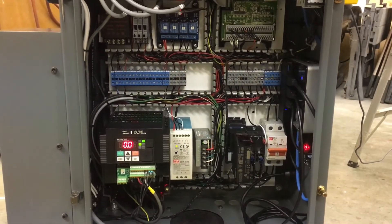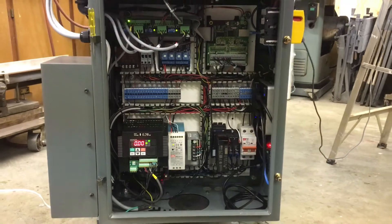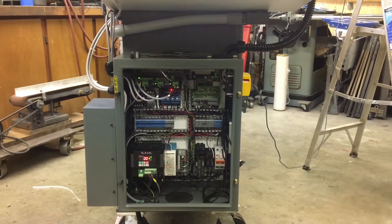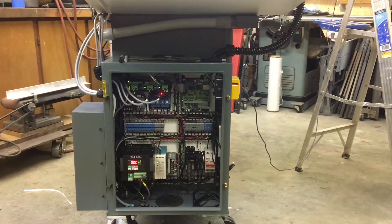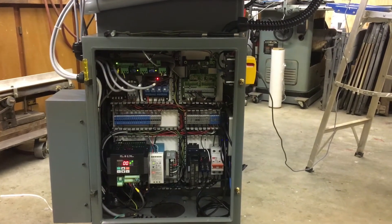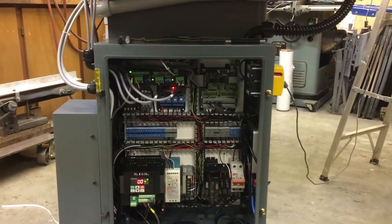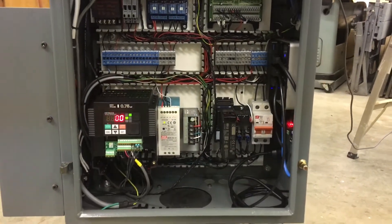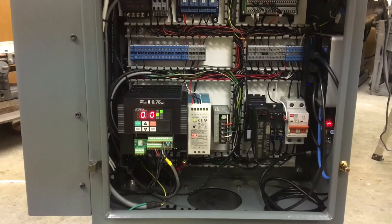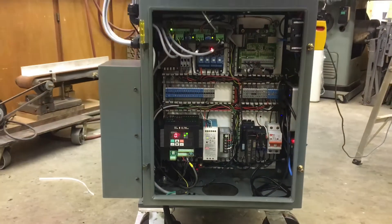When the MX 3660 does its 8.9 volts, the drive will see that as 10. There is still some error on the PWM side of things depending on what speed you're running at, and I'm not really sure what the expected accuracy of PWM open-loop control is over a range of RPMs. So we're definitely looking to add an encoder or something for some closed-loop action, or just figure out how to do everything from ModBus — that would probably be the easiest thing.